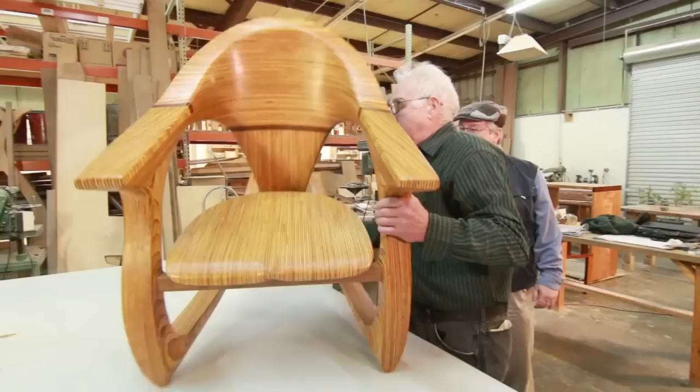In exploring the plywood material, I started out using Baltic birch, a half-inch solid Baltic birch, and it's a very heavy material. It's hardwood, and it's a lot more susceptible to movement, temperature and humidity changes, and air conditioning than the Douglas fir marine plywood or the Luan, the blonde mahogany plywood, which are softer woods, so they allow more tolerance for expansion and contraction. They're more stable woods to use. And I came up with this design very quickly.